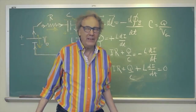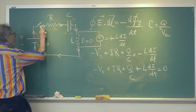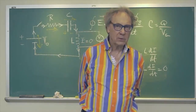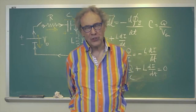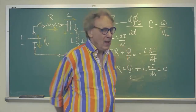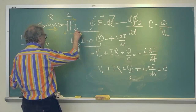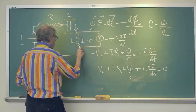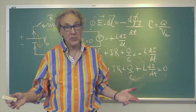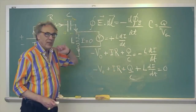And you will say, now what happened with your dΦ/dt? Well, what I have done in a clever way, by going around the circuit, is that I now no longer have any changing magnetic fluxes going through my open surface, which is now attached to my new closed loop. And my new closed loop, follow me, is like this. And look, when I come here, I bypass that self-inductance, I go through the voltmeter, and I come here. And so now Kirchhoff's loop rule should hold, and so the sum should be 0. Therefore, it shouldn't surprise you that this plus L di/dt is exactly what this voltmeter will show.